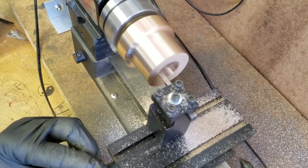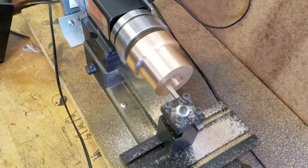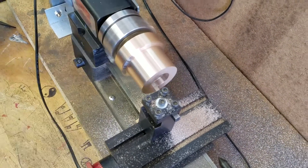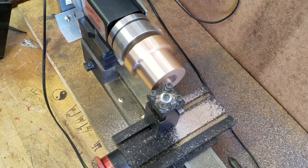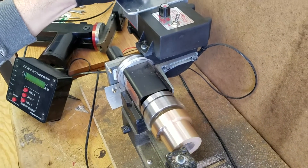Many people probably wonder, well, how do you know what the right size is? The right size in this case was determined by taking the radiator cap off the 1914 radiator and measuring it for thickness of the wall in the area where it's threaded. And we decided, if the 1914 was this thickness, probably making the radiator cap for the 1918 this thickness makes sense.